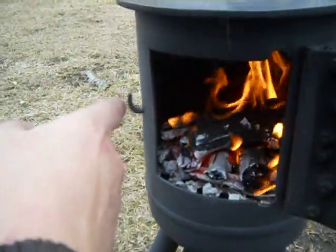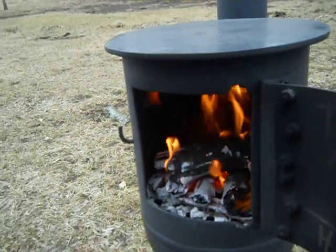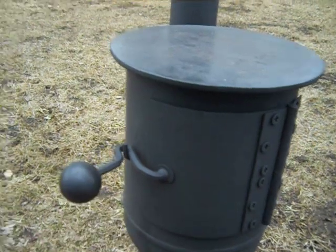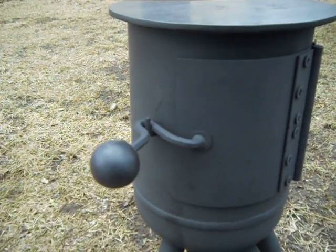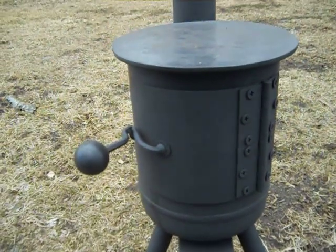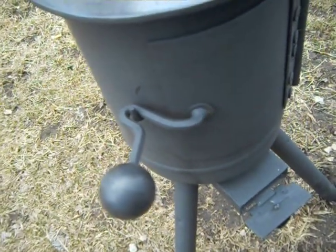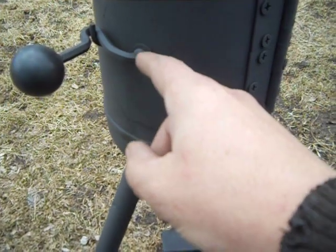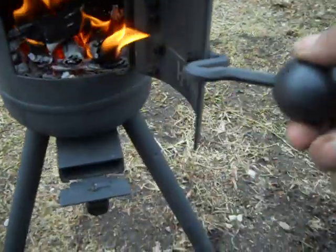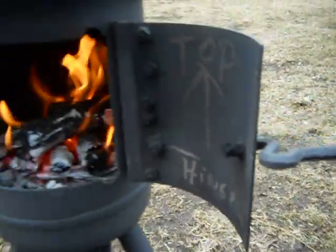That's a part of a link of a piece of chain, so it's already hooked. Just cut it just right like a J. Brazed it from the inside, which you'll never see. Made a nice little hook. I like doing amateur blacksmithing because I use a torch to heat my metal. That took some doing to bend, but a person could figure that out. This is welded to the Allen wrench, which is cut off real short with the elbow, and it's welded to a 1/4 inch carriage bolt with a washer, and it's double nutted, locked, so it stays tight.